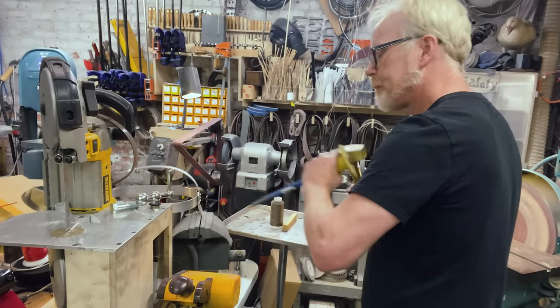And I'm trying not to get so close in that I'm bubbling the paint or anything. I'm just trying to gently, it's like you're cooking meat. I'm moving the temperature through the thing that I want to heat up. So now I can start to feel the heat behind the resin. This is also a great way, by the way, to reshape resin castings that have gotten misshapen, which can certainly happen in a hot car and all sorts of other circumstances.